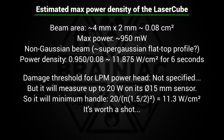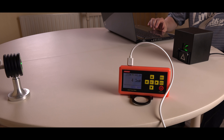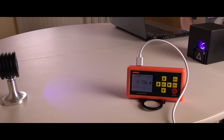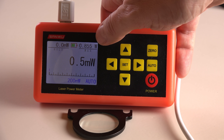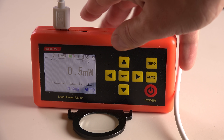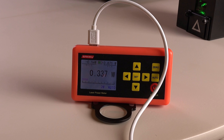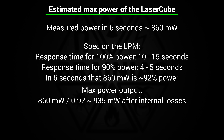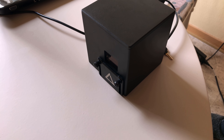Here you can see a lot of light being reflected by the lens — light that never reached the sensor. After some calculations I convinced myself that the sensor could cope with the focused beam for a short time. With the power meter calibrated for 450 nm, the strongest single wavelength from the Laser Cube, it reached 855 mW. At a more central 540 nm for all wavelengths, it reached 871 mW and was clearly still climbing fast. If the lasers and power sensor were given more time to heat up, and we account for the inevitable loss in the internal optics, I believe the lasers performed to spec. Just under one watt may not sound like much, but it's intense.